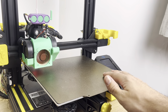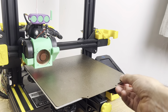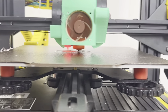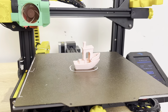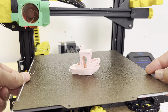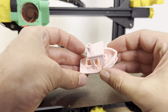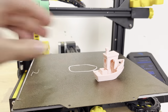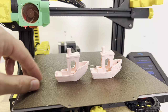The last print with loose Y axis roller wheels was a little too smooth, so now I've taken things to the extreme. If you see this bed, it is all over the place because of these loose roller wheels on the bottom. Here we can observe our 3D printing see-saw as that thing rocks back and forth throughout the print. This time the loose Y axis rollers have made a difference — I'm guessing part of the print was printed level and then halfway through it got unbalanced. So I basically have two different halves of this boat. Don't leave your Y axis rollers super loose.